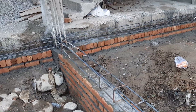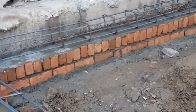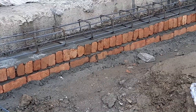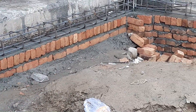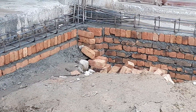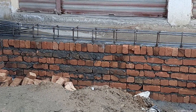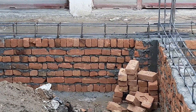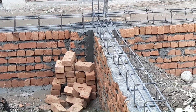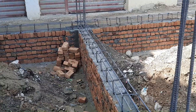The size of this beam is 9 by 9 inches, which is wrong. As I told you in many videos, from ACI codes the depth of the beam should be greater than its width, but this is a square beam — 9 by 9 inches. The depth should be minimum 12 inches for a plinth beam.